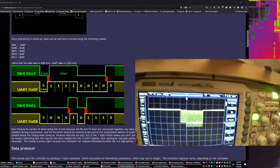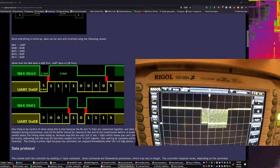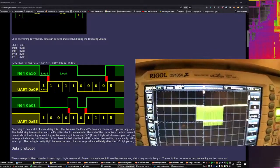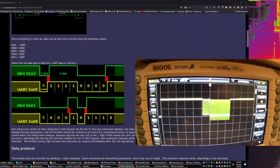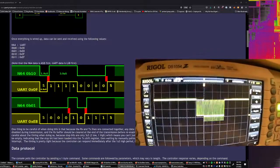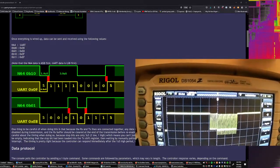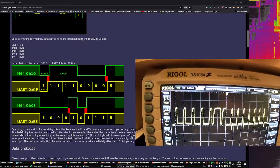And so every so often, and we could get the exact timing off of this chart here if we really cared, but I'm not going to worry about it too much right now because I want to be able to understand whether these clock signals are working correctly. We don't really care about the exact protocol right now, but we want to see a high level as the normal hold, no data being sent signal over this one data wire. And then every once in a while, we should have a blip down to zero.